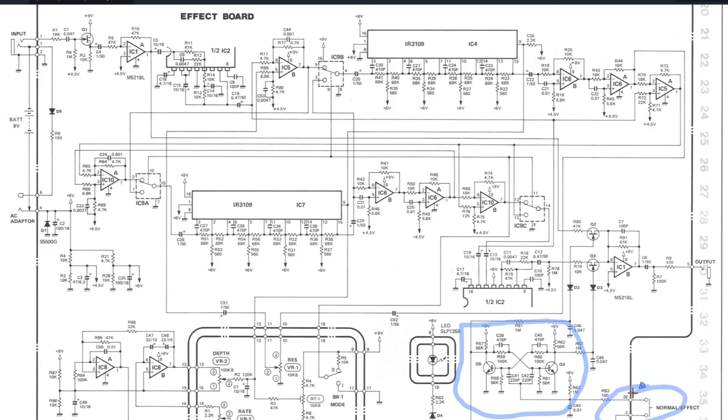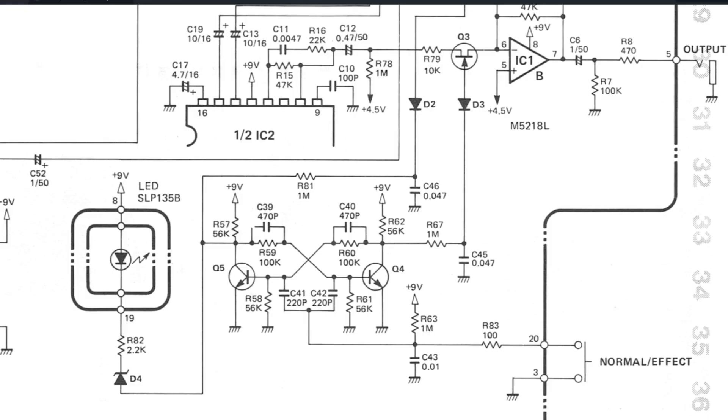Here is the foot switch. Everything is initially off until you either plug in a battery or plug in your power adapter. And once you do that, you're going to get your 9 volts here and here. What's going to happen is you're going to get current flowing. The current is going to flow from here through that resistor, through this resistor, down here, through there, and down to ground. It's also going to flow on the other side down to ground.